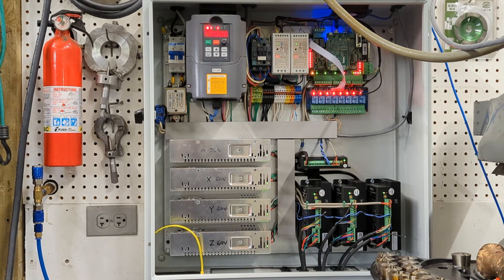The cabinet has its own breaker so it's protected above and beyond what the wall circuit provides. I have a power filter in there, and I went ahead and put four power supplies in — three of them are 60-volt to run the big stepper motors, and one 36-volt power supply that runs the A-axis on the rotary table. I've got a couple of 24-volt power supplies up at the top, a latching relay, and then the three large CL86T Lead Shine closed-loop stepper motor drivers. Those work really, really well.